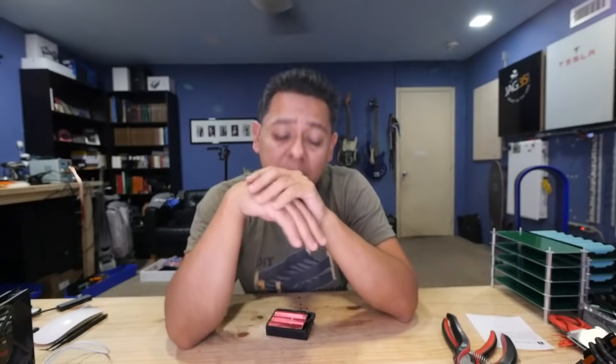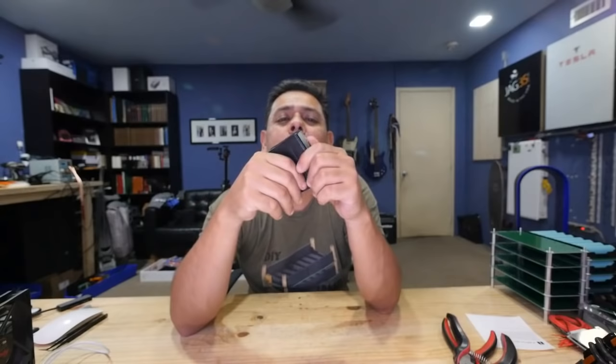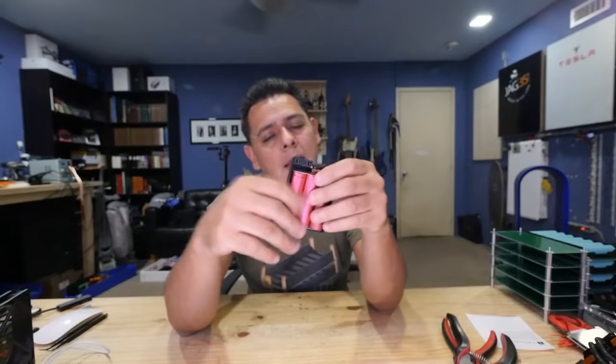So that's why I wanted to try these. I mean, I can buy new cells. I have new cells. I can pop a bunch of new cells in here, but I want to try to do stuff that a lot of you guys are going to do. You guys are probably starting about the same here. This is probably equivalent to what you would get from laptop batteries, because you don't know what you're getting. I remember processing a bunch of laptop batteries, and about 50% were over 2200 milliamp hours, and 50% were just below and were no good. So that's why I'm doing these.